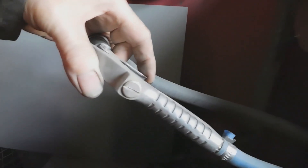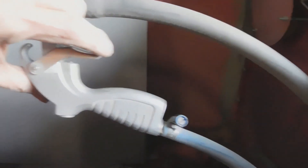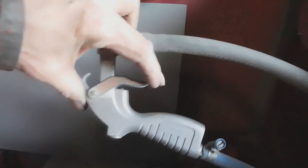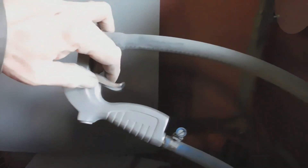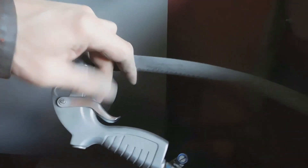The regulator is constantly on it — you can see it's constantly got water in it when it's running, so that catches a lot of water. We can't go straight from the tank; we've gotta have a regulator, because we've gotta have a pressure differential to cause the separation of water. If the pressure on both sides of the regulator is the same, it's not gonna catch water. So the compressor side's gotta be a fraction higher so that this is catching water before it actually hits the cabinet. Somebody — Brad — asked me about the trigger there. I just took the screw out, took all the pin and muck out, and the spring, and just jammed it back. Now it's just open all the time.